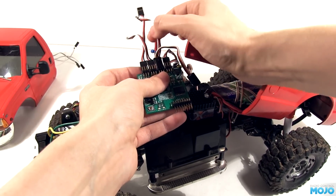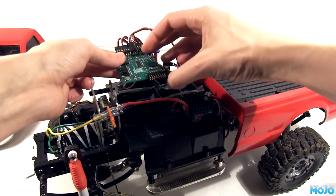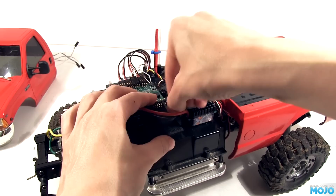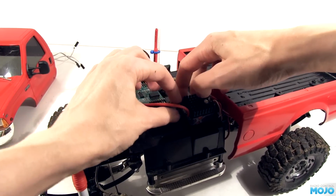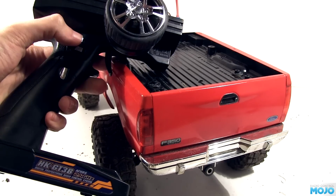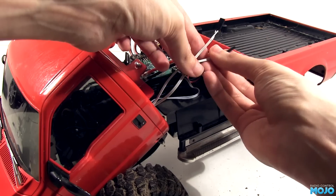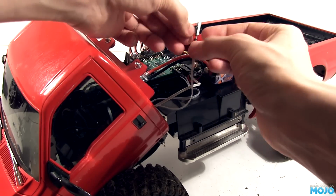Going to stick the controller in with some good old servo tape on the gearbox. No need to do anything fancy unless it needs to be waterproof. Then a bit of conformal coating might be a good idea. First, since they're there, I'm going to connect up the tail lights. There's no reverse lights on this model, as I kind of painted all of the lenses red. Yeah, they need to plug into the left and right tail channels, and a quick test. Yep, looks good to me. Using the steering trim buttons for the indicators. Now for the cab, only have the headlights and 2 indicators to connect. I have some ideas for the aux channels, but more on that when I get to it.